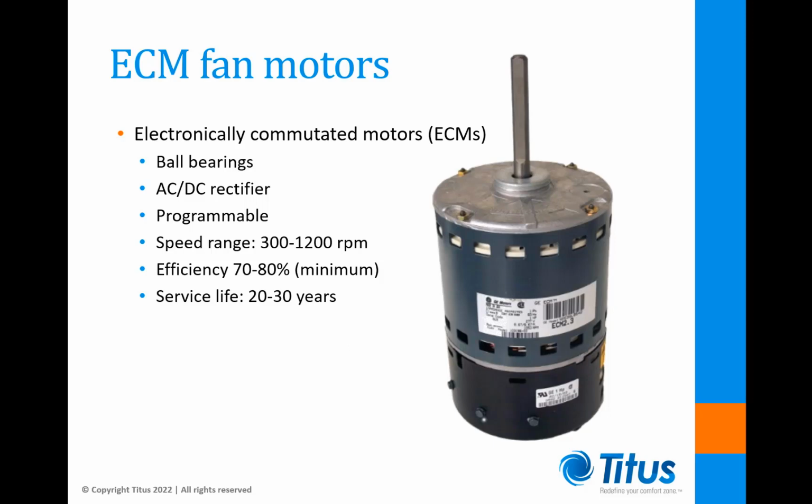Applications that have a fan running during cooling are generally required to have a minimum efficiency of 70%, requiring the use of an ECM fan. Applications that only run the fan during heating are generally still able to use PSC fans.